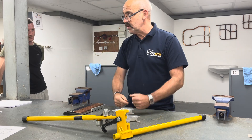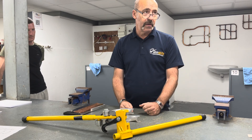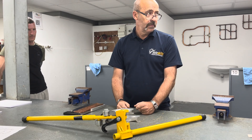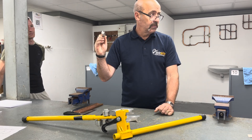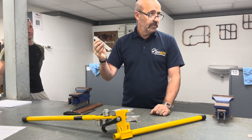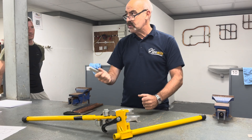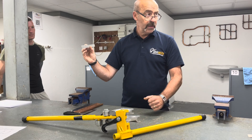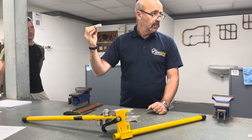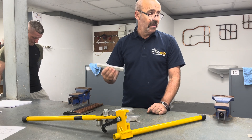These are standard industry straight arm benders. You can get fancy ones — Barco, Rothenberger, things like that — which are specialist. The only difference between them and these is they'll give you a much tighter bend, that is all. With standard benders come standard guides. These get worn out — they come in a cardboard box in bubble wrap. Look after them, because whatever gets into them will be transferred into the pipe when you bend it. Don't just chuck them in your toolbox. If you damage them, because they're standard, any standard bender's guides will fit. They're not that expensive. If you've got specialist benders, you've got to go back to the manufacturer and pay upwards of 50 quid for a new set of guides.